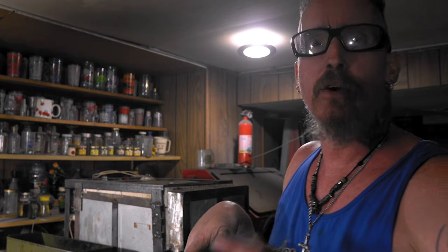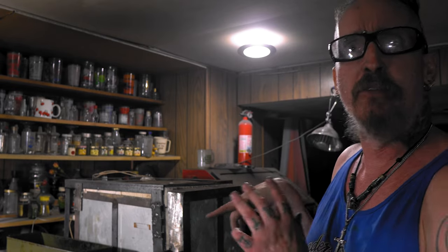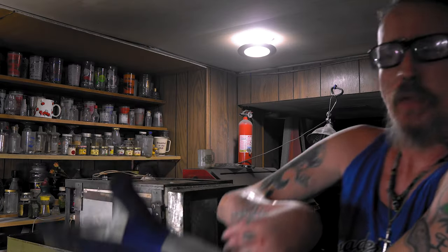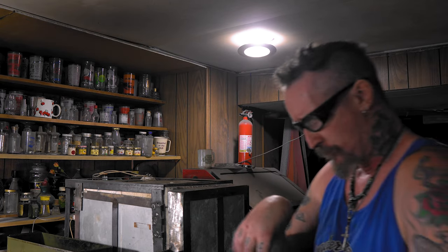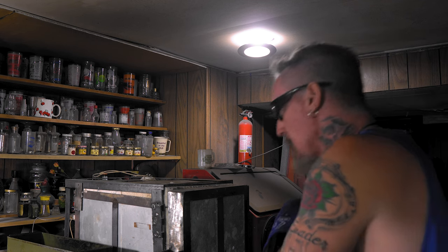Now, New Jersey Steel Baron says 1475, just like W-2. But all the knife forums I read say 1500 to 1550, 10 to 15 minutes. So I do 1500 for like 10 minutes. I'll be back when we're out. I'm gonna do the last two. I'm just gonna dunk this one. The last two are gonna go off camera. No reason to repeat it over and over. Just in, wipe it off.